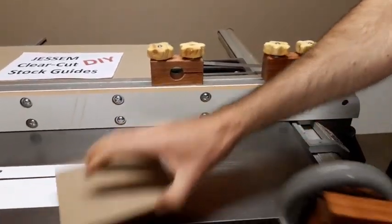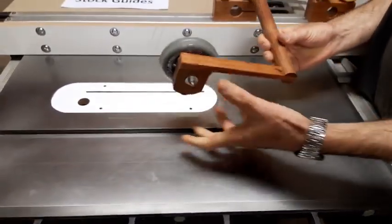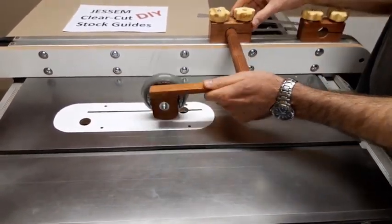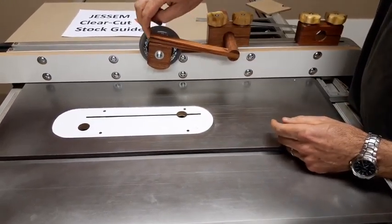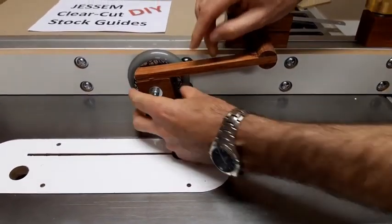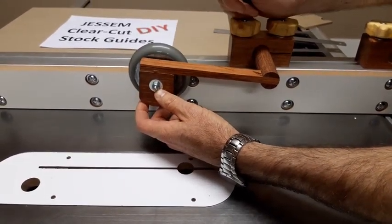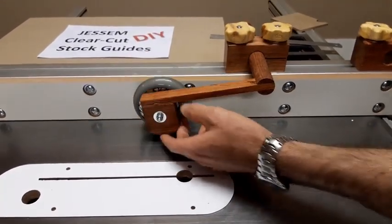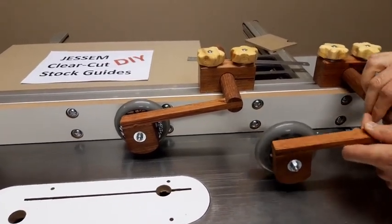To provide the downward pressure, this is basically what the rod and the arm and the wheel looks like. The rod is 25 millimeters to go through the hole, and then at the front you will see I've glued in three thin strips of hardwood — in this case it's African rosewood. Then I just made a mounting block with a six millimeter hole and used inline skate wheels that I bought at my local sports shop. And then obviously one for the second mounting block as well.